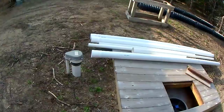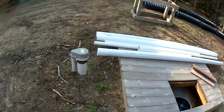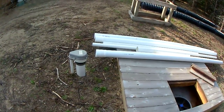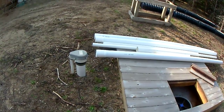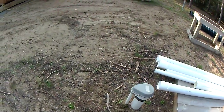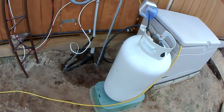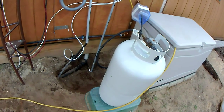The water pump is a 12-volt one from eBay. It can fit all the way down to two-inch pipe, but I went to full-size pipe in case I ever want to upgrade and run it like a regular well off 110 once my solar and battery power gets up to snuff. Right now the 12-volt pump works pretty good. Then it goes underground all the way over here and that's where it comes into the cabin. I had a freezing problem — I've got to get a little deeper. But this is what this whole deal is about: learning lessons.